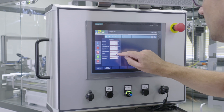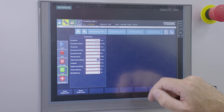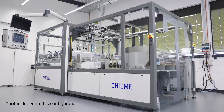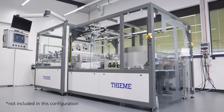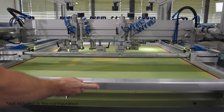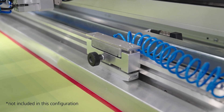All printing parameters including squeegee pressure, dwell times, and squeegee and flood speeds can be stored in a recipe. As a new feature, the machine will also be offered with a screen slide-out with high precision guiding rails and locking control to allow screen cleaning outside the machine.